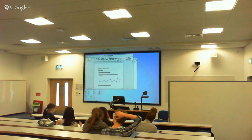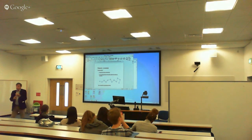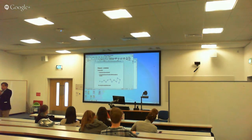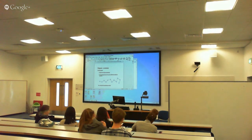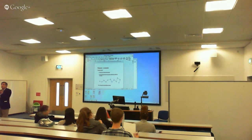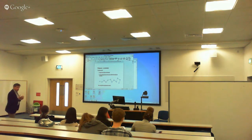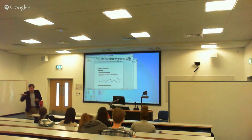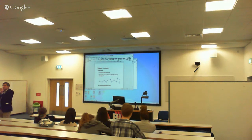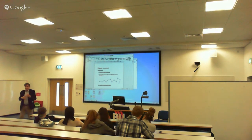I think I covered metal. I covered various types of metal. I covered steels, and in steels, we covered carbon steel and then alloy steel. Remember, with carbon steel, you need to know the difference between low carbon steel, medium carbon steel, and high carbon steel. This is what you need to know about carbon steel. These are the cheap materials, okay? The low cost type of steel.